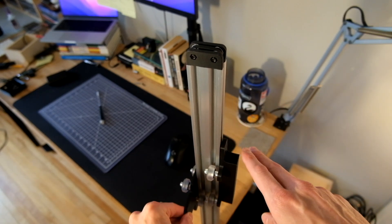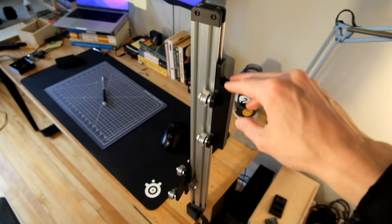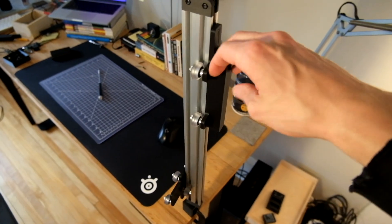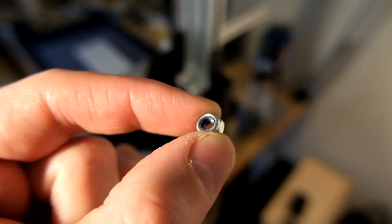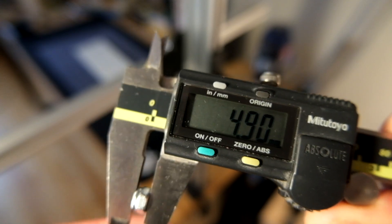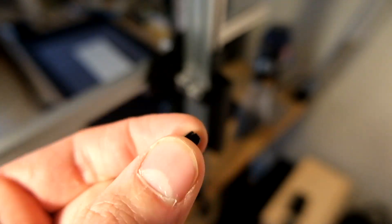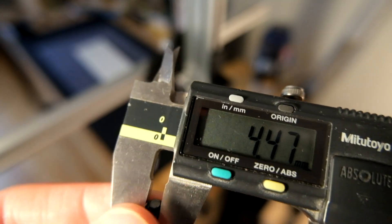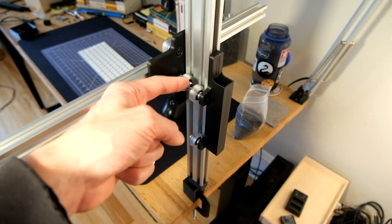There's one small problem — the nylock nuts that hold the wheels on are actually colliding. But they're only just touching so I'll fix it up pretty easily; I'll just make a small revision. The important part is that in the area where the wheels aren't colliding it's very smooth. I think I have a simple solution for this collision problem. Right now I'm just using the standard nylock nut that comes in the OpenBuilds wheel kit, and it is about 4.9 millimeters thick. I really just need to shave off like a millimeter or so. I found these lower profile nylock nuts — they look about the same on the surface but they are actually 4.46 millimeters, around 4.5 on average. If I use one of these new nylock nuts on both the carriage and the counterweight I'll save myself about a millimeter between these two, and I think that should give us enough clearance.